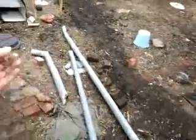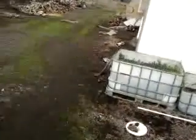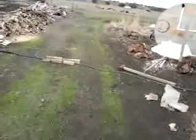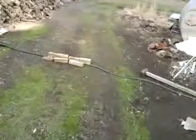It's almost like having a little tank or a bathtub, and you run water into the bathtub, and then you've got a connector at the other end of the bathtub that takes the water out, and it just releases any air out of the system. Well, you don't need that. All you really need is this T-piece and this line that sits up, and it'll release any air out of the system. And sure, it'll fill up with a little bit of water in the first foot or so, but that's why it's going to be 6 or 7 foot tall. Get the air out of the dam system, and it seems this is probably the best spot because this seems to be where it all chokes up.